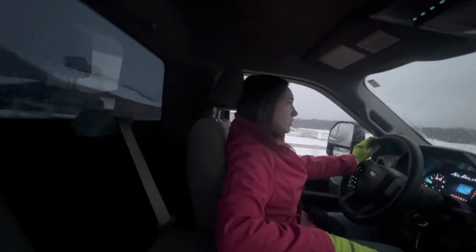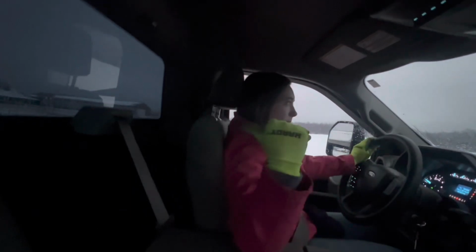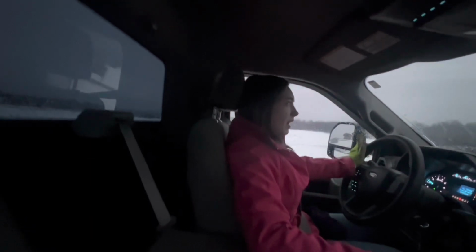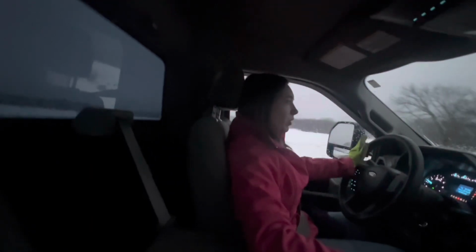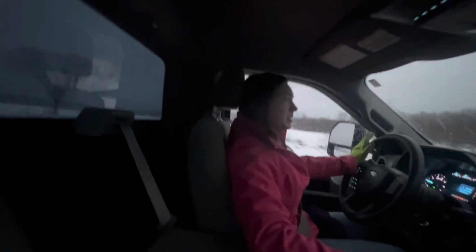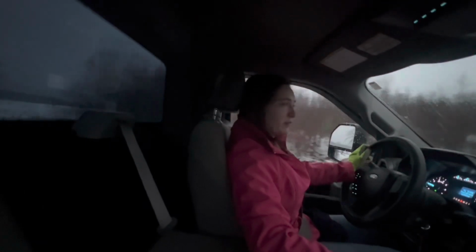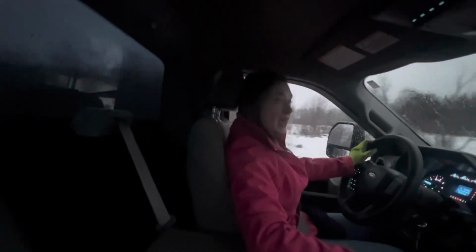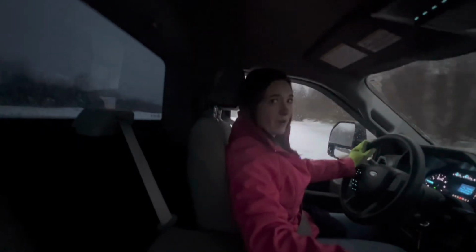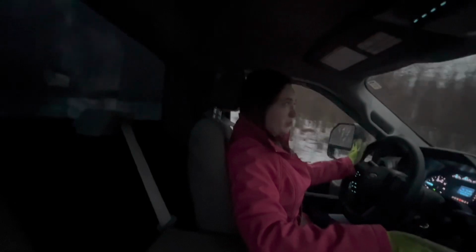So I wanted to mention also about the wood that we're using for the ceiling upstairs back here. I asked Dad, because obviously I know that people usually use dry wood for this kind of stuff, and I don't want anything to be warped in my house. And he said that, first of all, we are doing this whole renovation at a snail's pace. So he said, you're not going to be putting up sheetrock for months now anyway, and by then it would be totally dry, and it'd be fine.